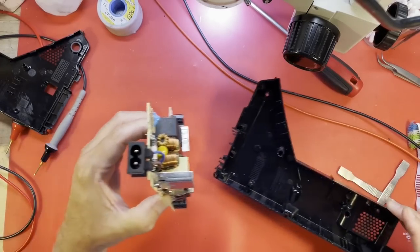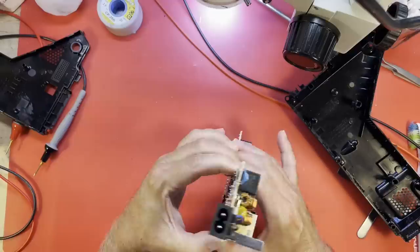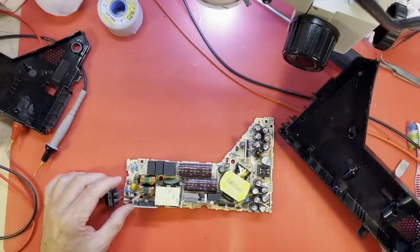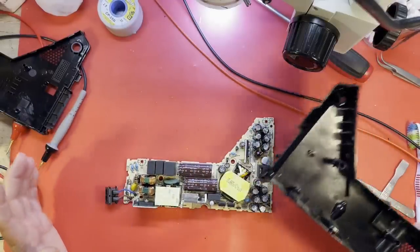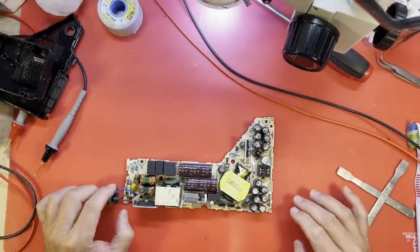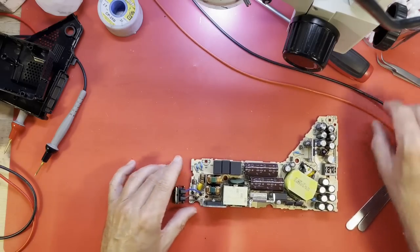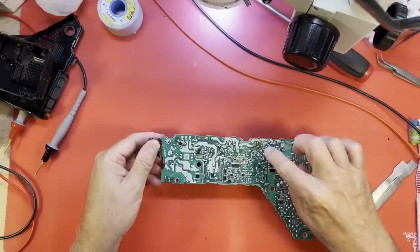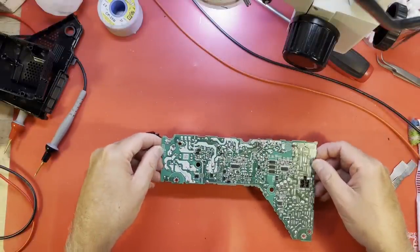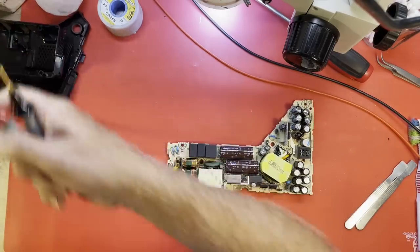Oh, this was a separate vendor. But this one is also going to be roach damage. I mean, it's like one or two roaches, though, so I really can't complain about that. It's not like it's just crawling with them. So yeah, I do see a little scorch mark right there. So we know where he crawled. And sometimes that's helpful. Gives you a place to start.